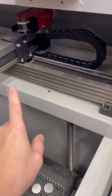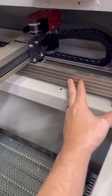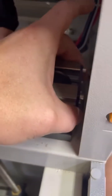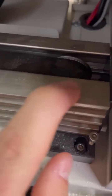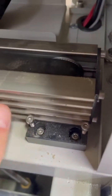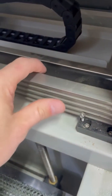Now we're going to check our Y-axis. These are the Y-axis belts, which run front to rear on the machine. We have one on both sides and they're set up the same way. Up front you have your two bolts, which go side to side right here, and you can see the belt running right back there. One on each side pulls this roller back — just double check it with the finger test and see.